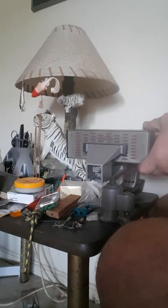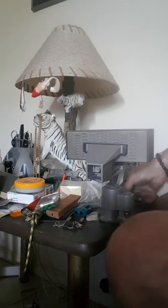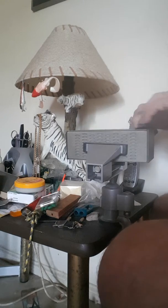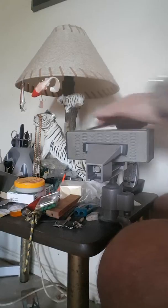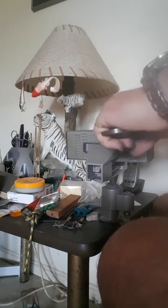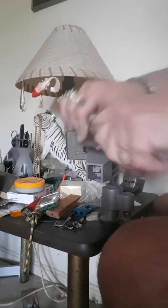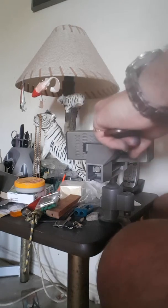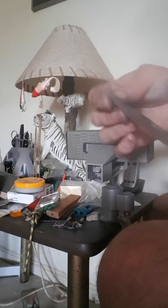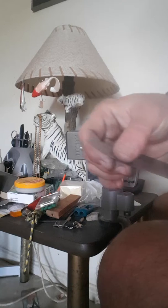I'm going to change it to the red, which is the last grit. You know, I was dumb enough to go out and spend hundreds of dollars on a Ken Onion workshop. I rarely use it because I'm doing exactly the same as what the workshop does. The workshop might do it in a hundredth of the time, but you're also going a lot quicker and there's more margin for errors — you want to keep the tip the way it is. If you're not doing it properly, before you realize it, you've rounded your tip off.